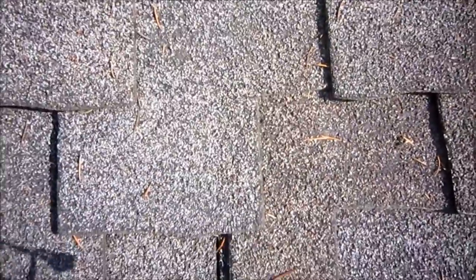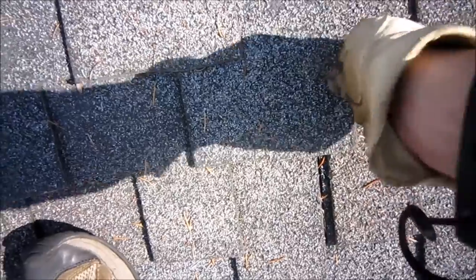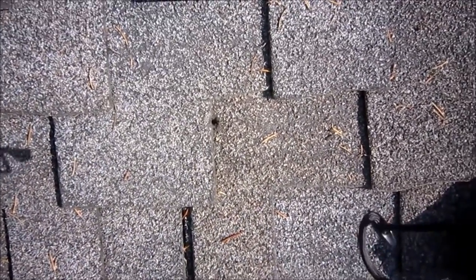When you go to drill, move your rail out of the way so you don't bottom out, and make sure you're coming at it straight. I can tell from how the drill just popped through that I missed the truss — I can jam a long drill bit in there and I'm not finding it at depth. So it's to one side or the other; the truss is probably lying like that. I'm going to make another hole right there and fill that one in. Try not to do this 500 times on your roof, but you do get the hang of it, and the different thicknesses of the composite on top of the roof can make this a bit of a trial and error job.